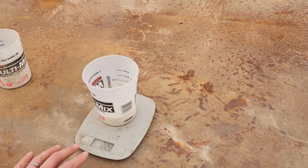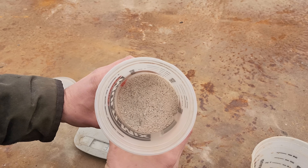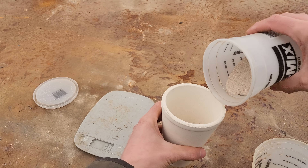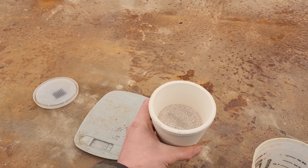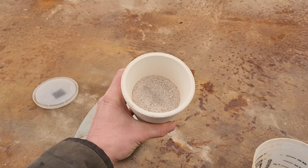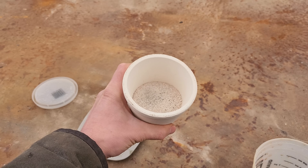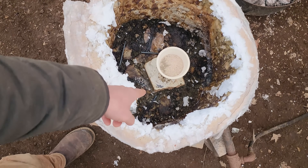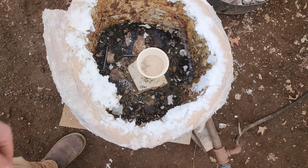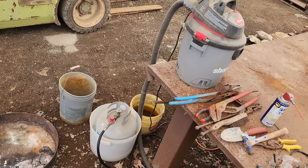So now we have a flux that's about two to one from our ore. We're gonna mix these together - there's our stuff all mixed up. We take one of our fire clay crucibles and pour our charge in there. In the past I've used iron nails to deal with the sulfides, but we're not gonna add any iron this time. Now we're gonna go put this in our furnace and smelt it. It's a little plinth - I think it's called - just fire brick with kaowool wrapped around, and we run it off propane with a blower setup.